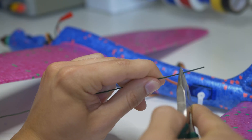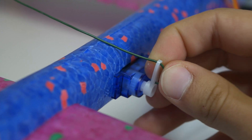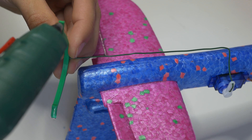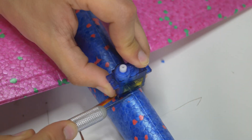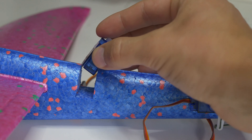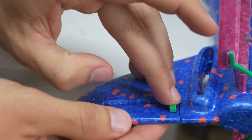I cut out the marked pieces of foam and used packing tape as hinges — not the most elegant solution but simple and light. I positioned the servos so that the center of gravity stayed in the right place, and cut out foam to hide them as much as possible to reduce drag. With small 3D printed parts and wire I connected the servos to the elevator and the rudder.